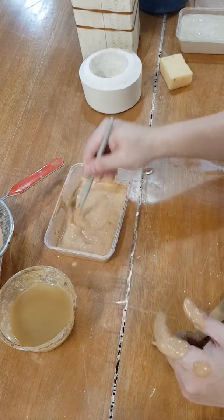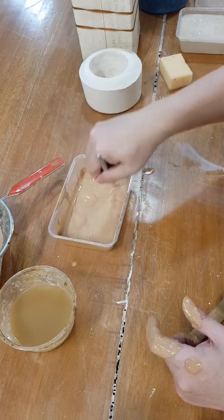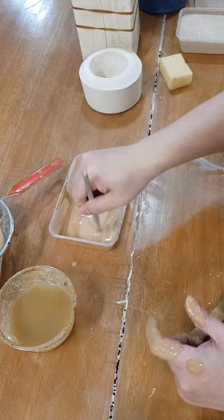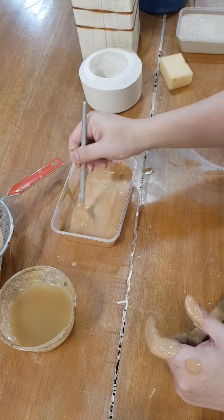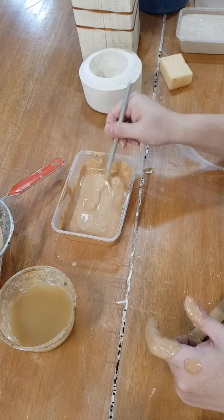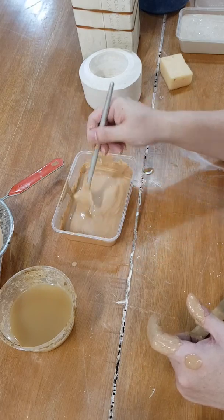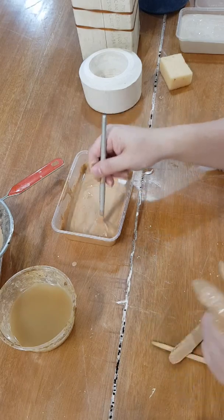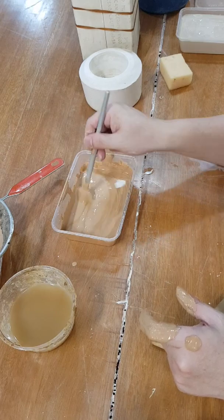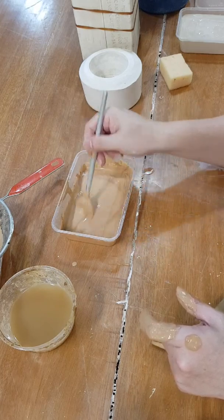What kind of consistency you want? You want like a flowing. When you pour, you can actually pour. Does these clumps matter? It will still cast, but your result of the casting might not be smooth if it's still clumpy. So they will remain like these clumps that are like sticking out, kind of bumpy in the clay. Okay, but if you fire it and all that stuff, it still works. It's just the appearance will be bumpy.